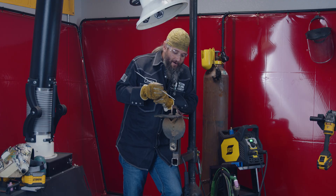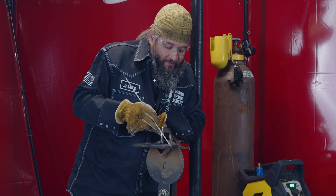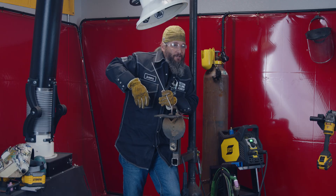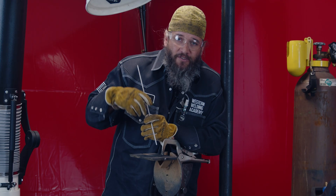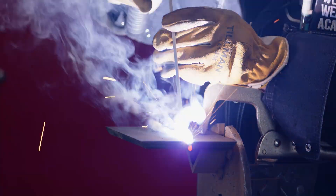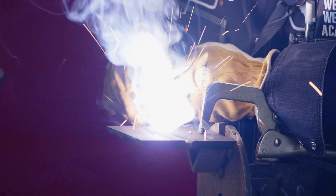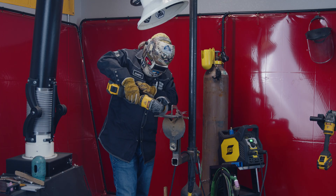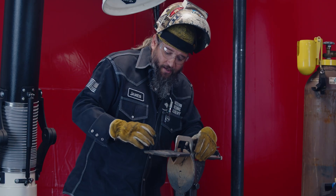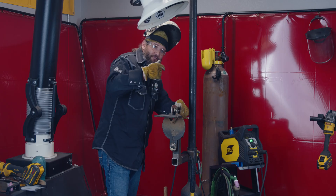There are a few little skinny spots but the walls are broken down, nothing is under flush - so we're going to rock and roll with it. Root is in, now we're going to put our hot pass in. I'll fire up off the end of the plate, get the rod burning, bring it in and get a puddle started. I'm not really weaving, just widening it out a little bit to tie into the sides - I want this bead to lay flat. Hit it with the wire wheel and it'll come out nice and clean. I wasn't able to finish in one rod, so I stopped about an inch early to give myself room to work - stop short and give yourself room, get a fresh rod and restart.